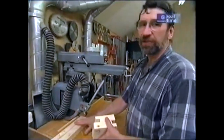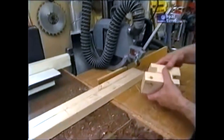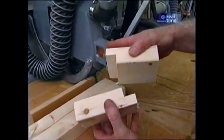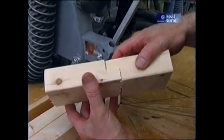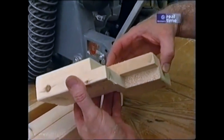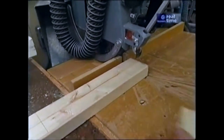I've started to work on the frame which is going to support the countertop plywood. It's going to be made out of 2x4s and all the connections are going to be made with half-lap joints. So I've installed my dado cutter in the radial arm at a little bit wider than a half-inch width, adjusted the height, and run some sample pieces to make sure I'm removing half the material to get a nice tight joint. With all the layout done on the long pieces, I'll just nibble away the material.